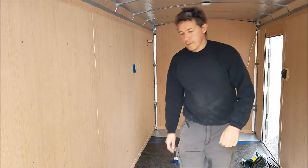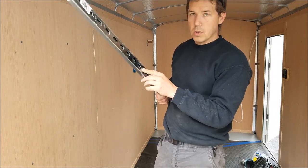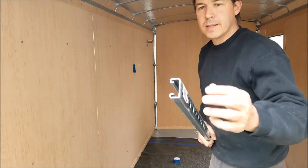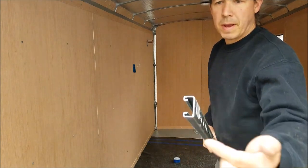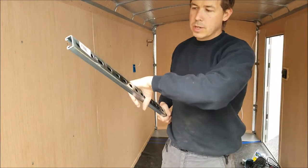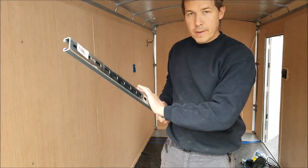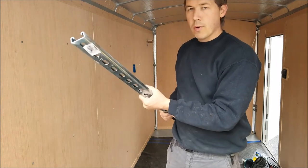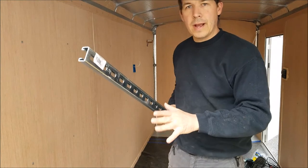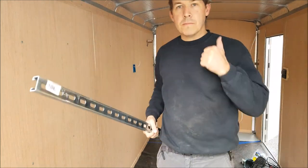In order to put these beds up, I'm using this material called super strut. I bought it at Lowe's — Home Depot has them too, prices are about the same. They make two sizes; this is the shorter size, and they also make one that's basically square. You can get all kinds of nuts and bolts that tie into these rails. They're mostly smooth, with a few small burrs since they're made for industrial purposes. They're nice and strong, fairly light, and fairly inexpensive — about $15 per stick for a 10-foot stick. So I'm going to get on to cutting these out.